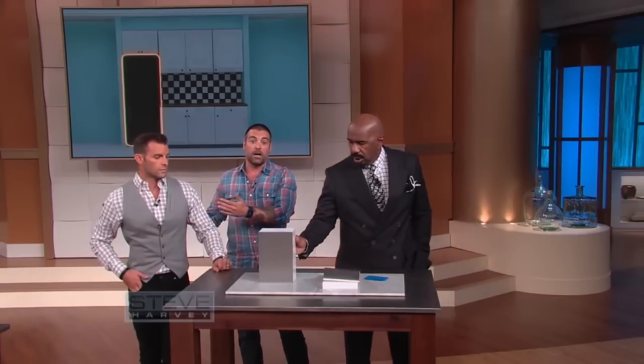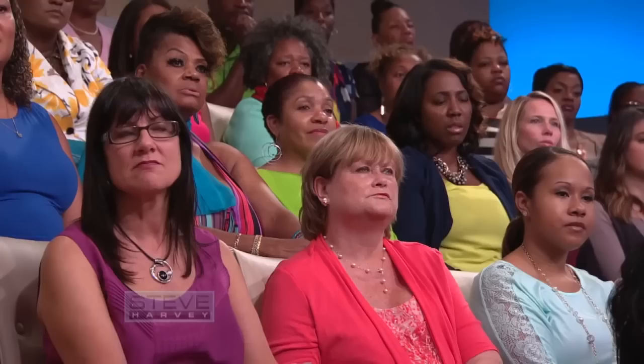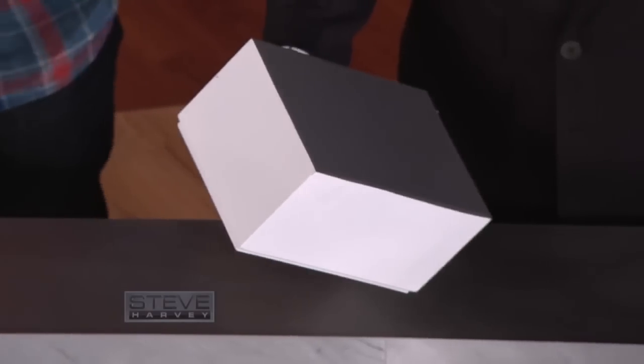Another one that we do all the time on America's Most Desperate Kitchens and Kitchen Cousins — especially if you have kids — chalkboard paint is a great option. If you don't want to spend the time getting all the stick-on stainless perfect and all the seams hidden, you can take your old refrigerator, bring it outside, Brillo pad, scuff it up, and then roll on some chalkboard paint. Chalkboard paint is not only black these days — it comes in every single color you can imagine, just like the paint on your walls. If you have kids, it makes a really family-friendly surface.